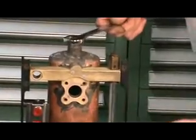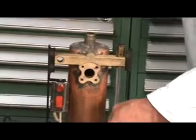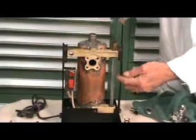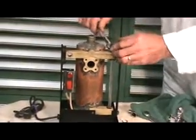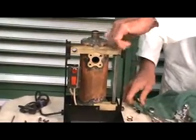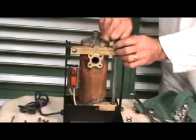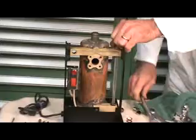And there are times that I've actually rebuilt a machine and there's been a little booger down here in the bottom channel. I filled it up with water and there's just been this thing floating in there and it just about breaks your heart. But in this case, all you have to do is take this out, back this off. Let's say you have a little scale in there you want to clean out. Take your brush and you're right back in business. You can reuse this seal over and over and over again.